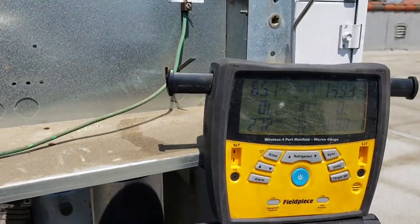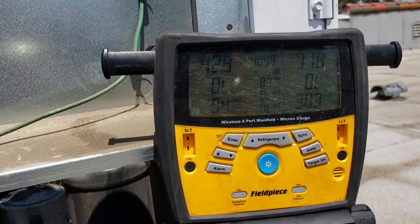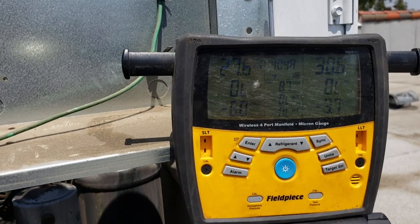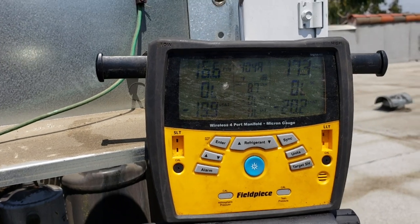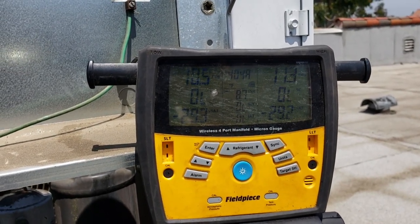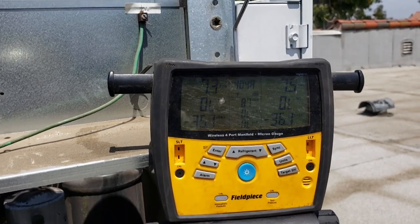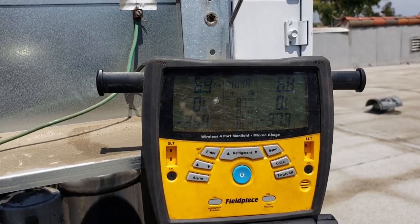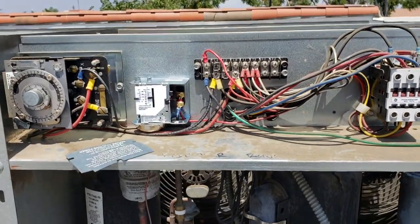And now it's running, and we're gonna pump the system down to about 10 to 15 PSI. And then I'll just change that pressure control while there's 10 PSI of pressure. It'll be no big deal. So we're just letting it pump down right now. We're at 14, 12, 10, chill right there. And mind you, it's probably gonna rise a little bit. So the whole point is we want pressure coming out the whole time I'm changing it. That way we don't ever run the system out of gas.